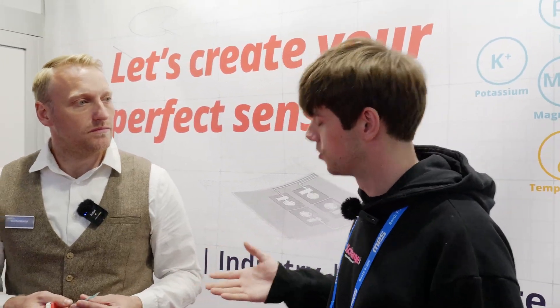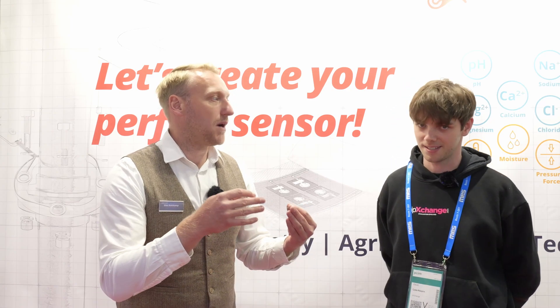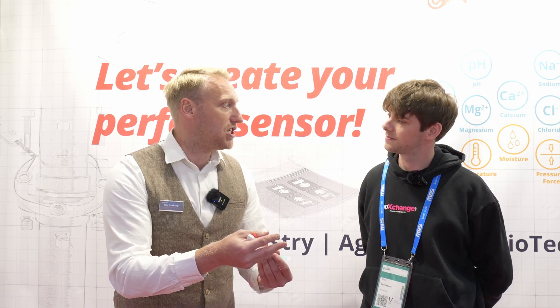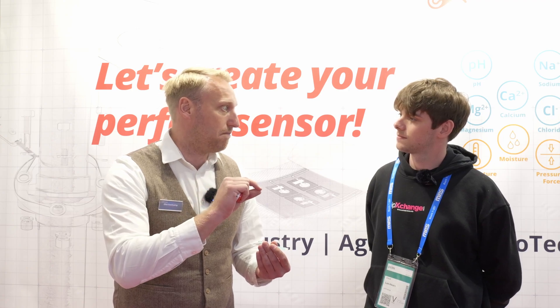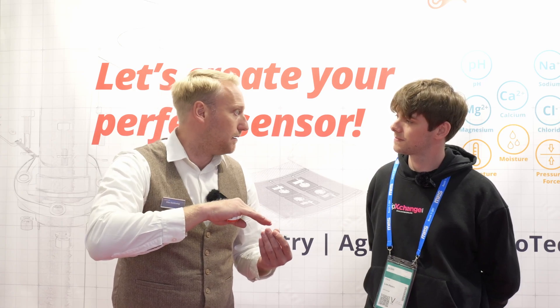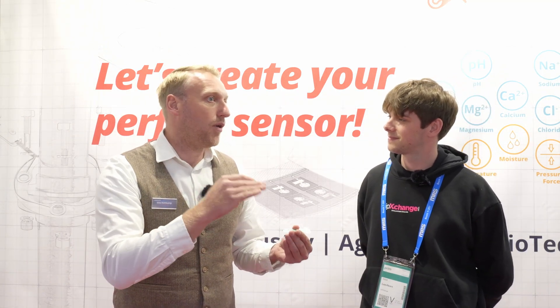Let's talk accuracy. These are not your traditional sensors — how accurate are the measurements from this new technology? To be honest, accuracy is not as high as a wafer-based sensor. But we are not focused on measurement — we are focused on monitoring. We don't want to measure one drop of liquid and get a single pH value; we want to see what happens with the pH value over time. That is continuous monitoring. For continuous monitoring, the absolute value is not the most important thing — the trend information is. What's happening with this pH value? Is it raising over the last 25 hours? That is what we want to see, and that is absolutely possible with our stickers.